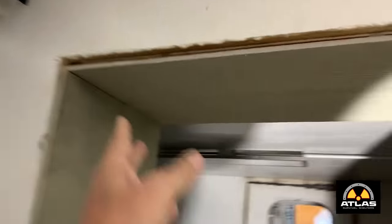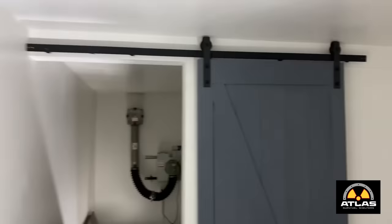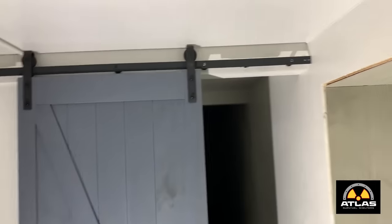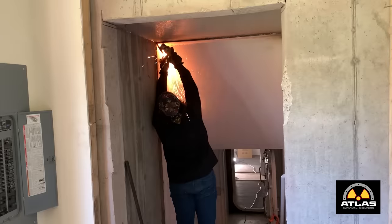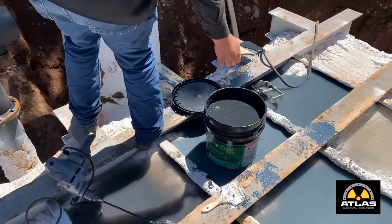This is going to cover all the welding that took place inside the bunker. He's also put a couple boards down the middle to raise the level so when they put in a piece of marble or tile, it doesn't cover the weld - it's down the middle. This will make the little doorway look as finished as it does on these doors. Hardy board is actually concrete, so this bunker has no wood in it with the exception of the wood in the doors and the counters. Everything else is this hardy board - it's composite and this stuff will last pretty much forever.